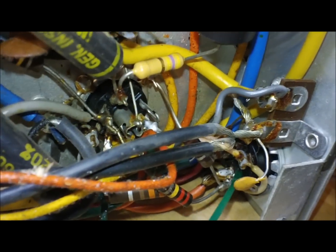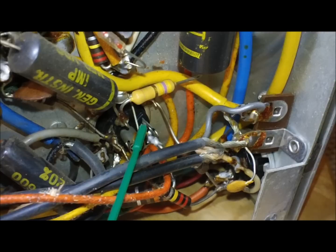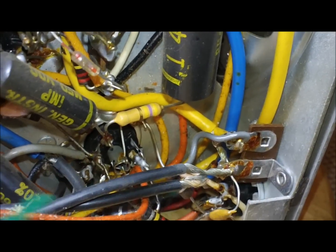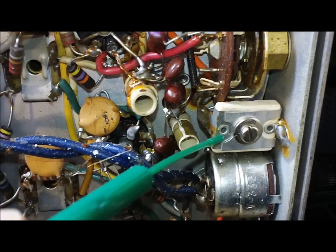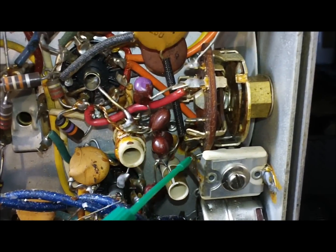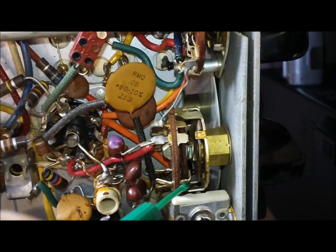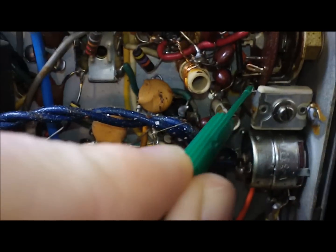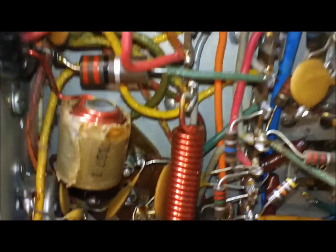This is original, that original mic jack on the bottom, the weird one. The wires for that 4-pin Amphenol are up on the top side. I guess I forgot to show you guys where that 4-pin Amphenol is. Since I've got this fancy carousel now, I'll spin it around and show that real quick. This might be a variable capacitor in that tunable receive, because it looks like one side of it's going to this switch, and I think this contact back here is on the tunable receive portion. So hopefully maybe that alone will get that line back up.